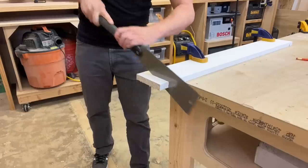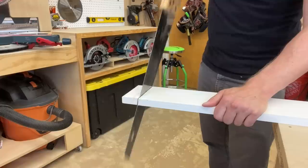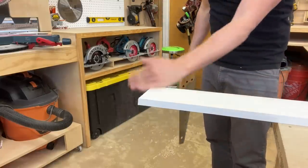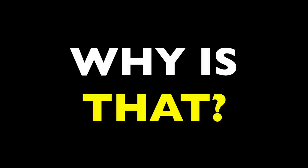This tooth orientation is also why the handles are shaped the way that they are. The straight handle of the Japanese saw gives you more control while pulling — you can even grip it with both hands. But the D-shaped handle of the western saw gives you more palm support while pushing. This also brings up our second most noticeable difference: the Japanese saw has teeth on both faces, whereas the western saw does not. So why is that?